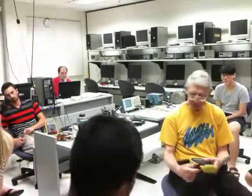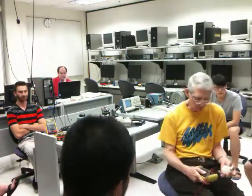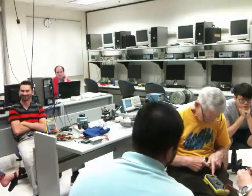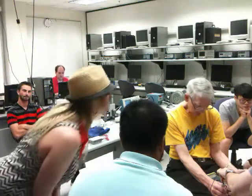Let's use this non-true RMS meter. I think it's good enough for ohms. V squared over P. And let's measure the resistance. What do you think it should be? I'll hold the bulb, put this thing on ohms. Put the leads together, see if it goes to 0. Make it good. 0.1, 0.3, so it's reasonably close. And you're hoping to measure 144, so make one good connection on the side and one on the end. Poke it, stab it, whatever it takes. Touch it with your tongue. And assuming it had 0.3 in the first place, it was around 9 ohms. What happened to 144?